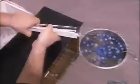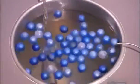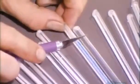They plunge the thermometers in ice water to calibrate the blue liquid to 0 degrees Celsius. They scratch the glass at that mark. Next, the thermometers warm up in a bath set at 93.3 degrees Celsius. The blue liquid shoots up, and they make another scratch.